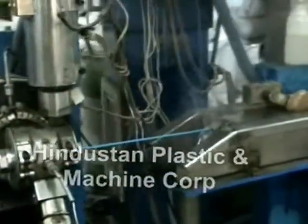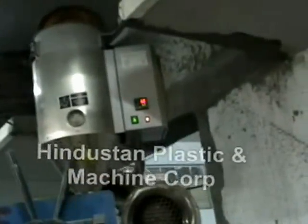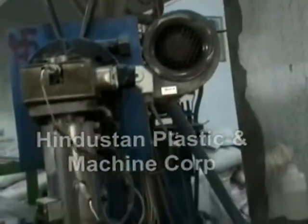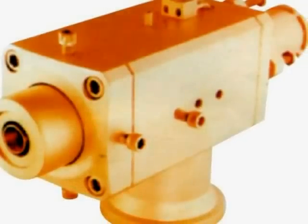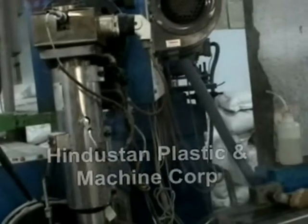It has a great space-saving advantage and could be easily changed for any line of direction. The second layer extruder has its base fixed to the ground and can be rotated 360 degrees. The crosshead is also self-centered, which removes the problem of centering the cable, providing the ultimate ease to change size and color during production.